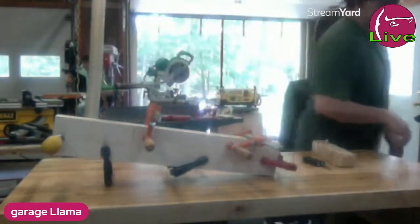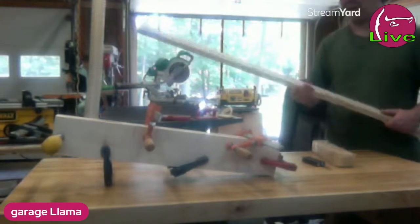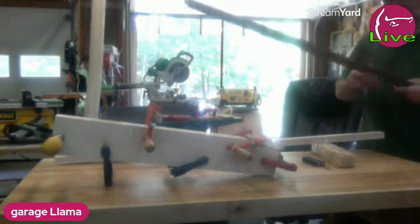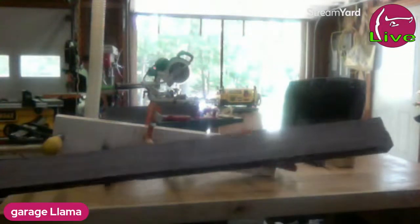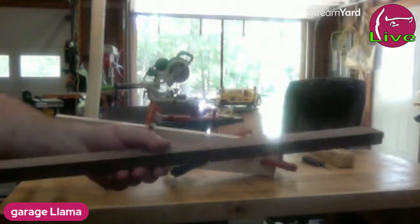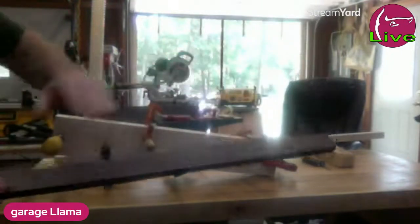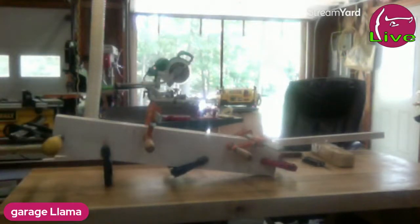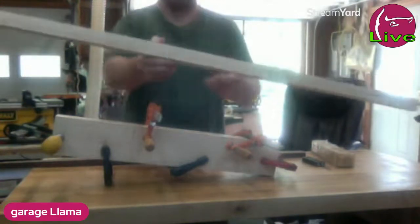I think I'm gonna kill the stream — I'm all glued up, don't know what else I'm going to do. I glued these together a long long time ago — same thing as earlier, just scraps. If I glue them together I can basically make bigger boards. Believe it or not, you can't even tell on most of this edge — I already ran it over the jointer. It's actually two separate boards on that side, hard to tell. On this side you can see the seam, but once you plane and joint it, because the colors kind of match, you can't even tell it's glued together — which is sweet.